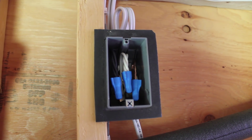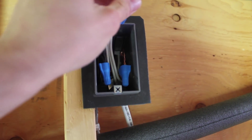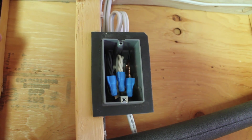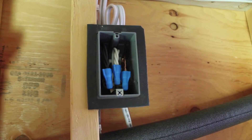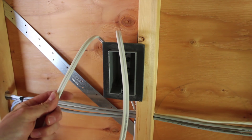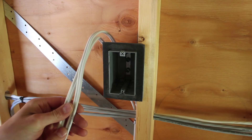Here's an example of a box that's just a straight splice through. There are three two-wire cables coming in — it's color to color and everything's a nice length so it can be tucked neatly away. We were going to have a plug here but switched to a 12-volt thing, so to accommodate the cabling we'd already pulled, we just put in a box to splice everything straight through. Here's a plug box with two two-wire cables — supply power and more plugs downrange — so these need to connect to each other and also have provisions for the plug that's going to be installed here.